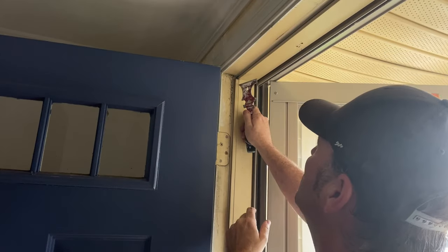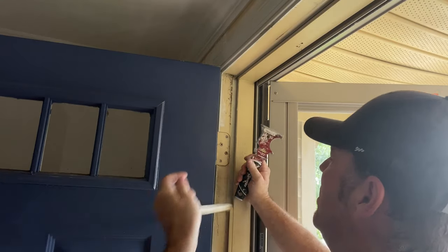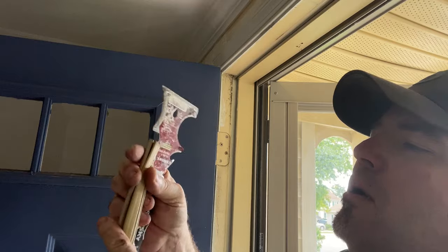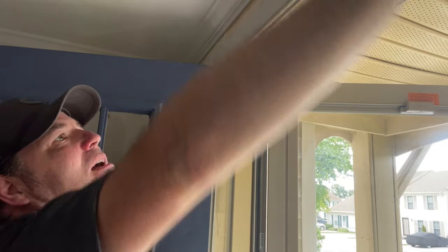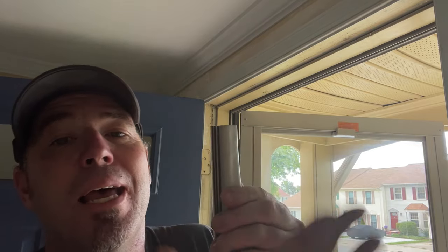And this one as well — it looks like it belongs, it's been painted the same color. Now this kind is the correct kind but it's super old. The newer pre-hung exterior doors come with this slot. Notice this slot here in the back — it's also across the top. That's because this door gets this kerf weather stripping. Notice the little shape there; it's got this fin that slides into the slot, and then the door presses up against it when shut and makes the seal.